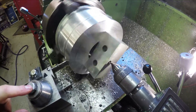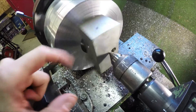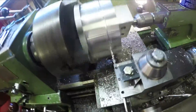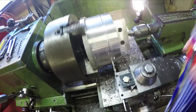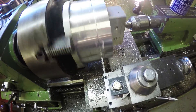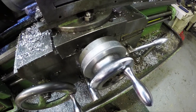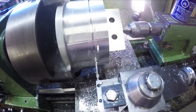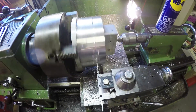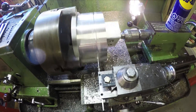It just occurred to me that I could snug this thing up if I could get the tailstock on there. I took this big block of aluminum and snugged that in there, and now I can just power feed into this thing. The power feed is on with a little lube - it's feeding in pretty slow. Still get a lot of chatter and it squeaks a lot, but look at that - it's going a lot better. This will make the job a lot easier.